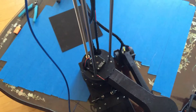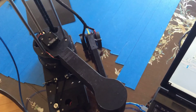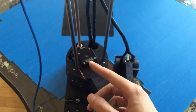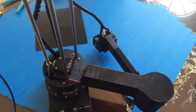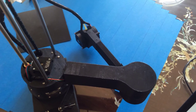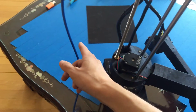That is the RepRap Power Arm update, but I should actually show this — a really weird y-axis behavior. I'm going to move the z-axis up 10 millimeters. You'd think the lead screw is going to spin and move the entire arm up 10 millimeters — but see what happens. It seems to be trying to home, but that's not home. I'm not entirely sure where it thinks it is, so I'll flip some of the measurements — maybe that's the zero-zero it thinks it is rather than the exact opposite.